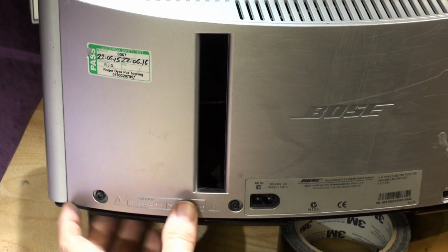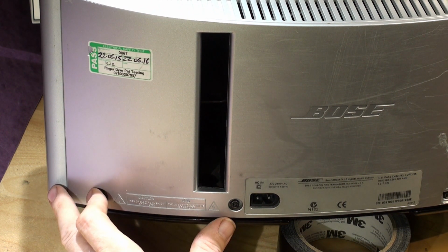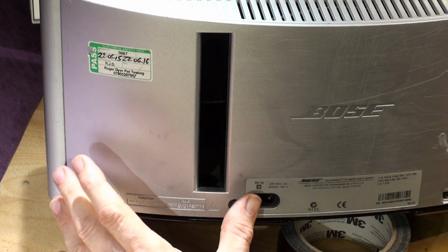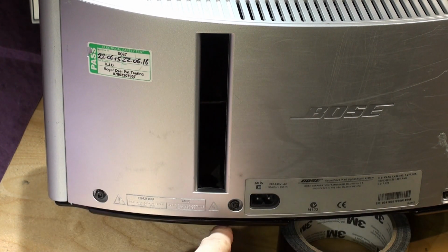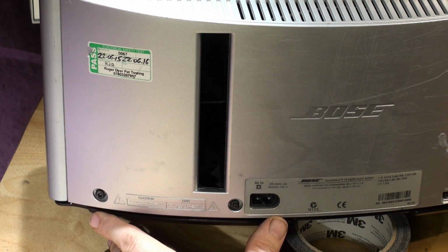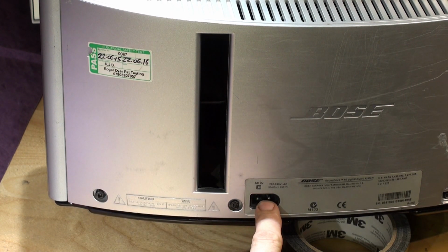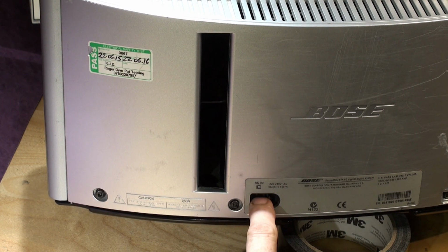There's a module in this section here, which is the power supply and power amplifier section, and it's this section which invariably fails. So we're going to deal with the removal of this, how to open the dock, remove the power section in preparation to send it to us for us to modify, repair and modify it. We strengthen this circuit in several places, and we make it much more resilient to bad transients, i.e. voltages and damaging electricity levels coming down through the mains supply into the socket.